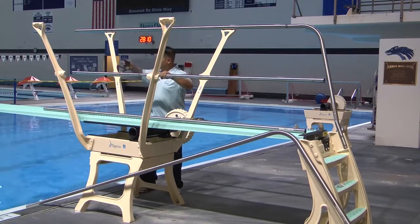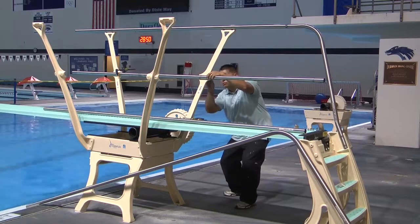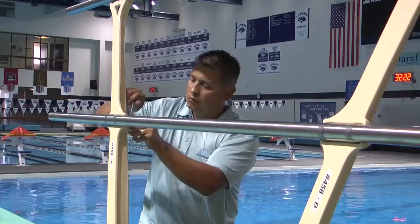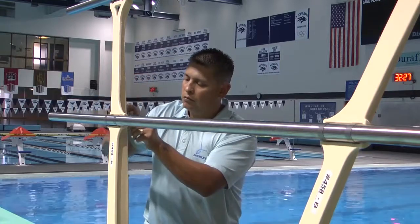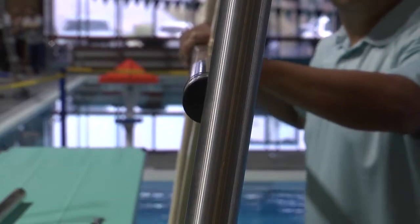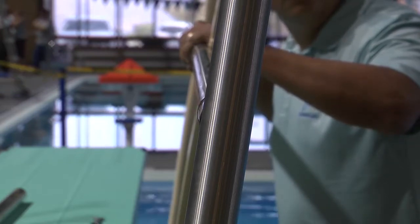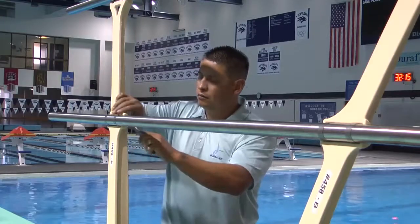Using an assistant or one-handed bar clamp, hold the rail in position and start a bolt in each rail clamp. Slide the straight rail into position so that it is nearly touching the curved rail. Tighten the bolts enough to hold the rail against the support arm, but loose enough to allow rotation of the rail. The straight rail has a slight bend approximately 44 inches from the ladder end. Rotate the rail until the end lines up with the curved rail and with the bent side down. Tighten the straight rail clamp bolts.